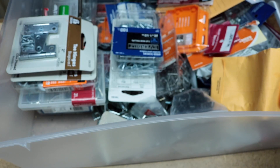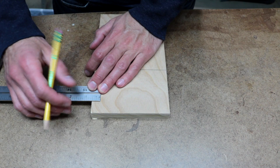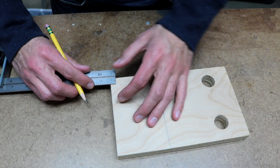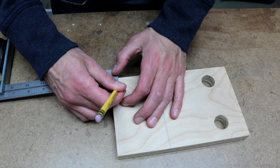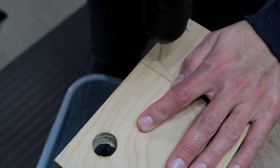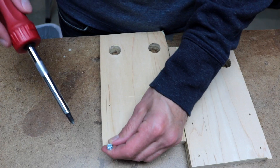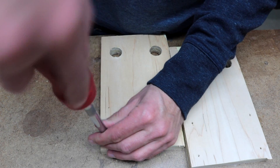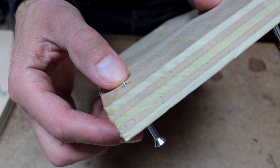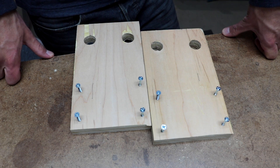Now you're going to need eight wood screws to drill your supports into your joists. I found some one and a half inch size eight wood screws. I made the pilot holes a half inch from the edge of the support and a half inch from the top of the support edge. Time to drill your pilot holes. And there are the finished supports. Now you're going to screw in all eight screws into the pilot holes — screw them all the way through the support so the points are protruding out the back.